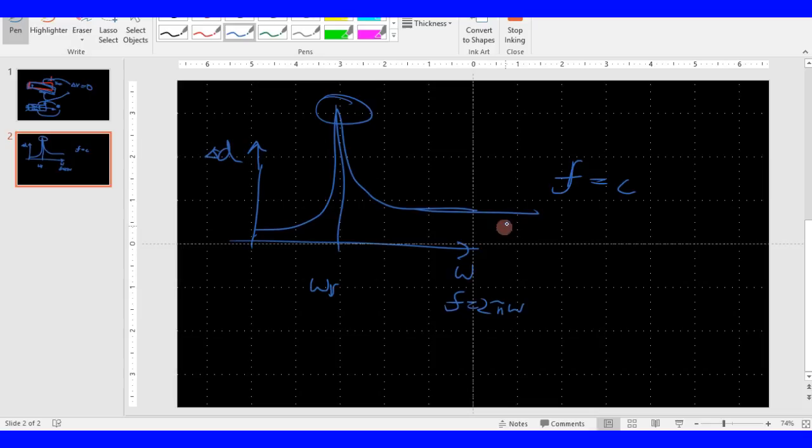You absorb significantly less energy than you would even before. So this graph, actually drawn properly, would look more like this. We'd probably start here, then we'd peak somewhere. Let's keep in mind it's probably logarithmic, and then it'd probably go down, and it would approach zero in the end if you increase to a theoretical infinite frequency amount. Then you would get zero displacement, and that would be zero voltage, and then also zero energy stored in the material, or zero energy which could be harvested.